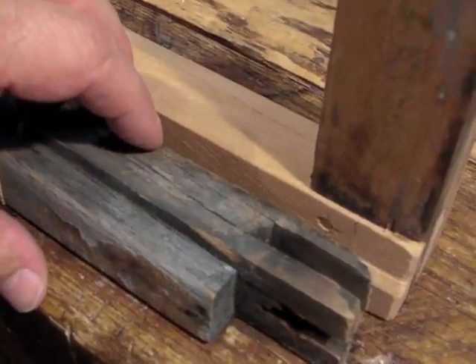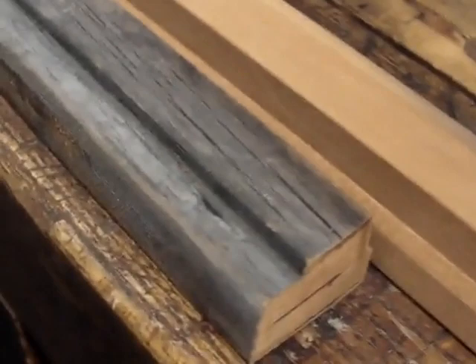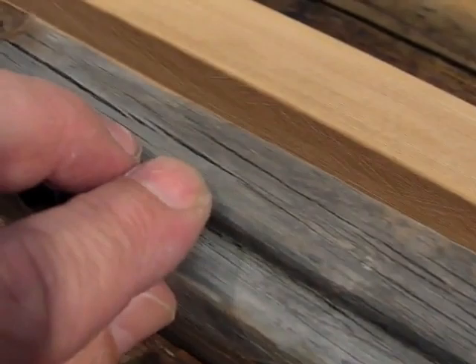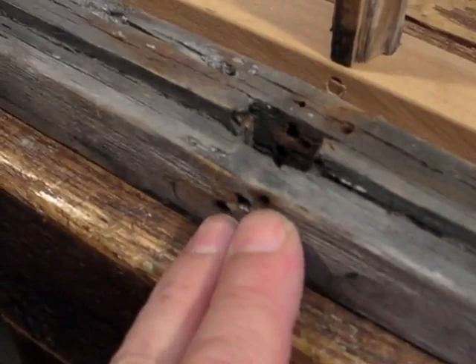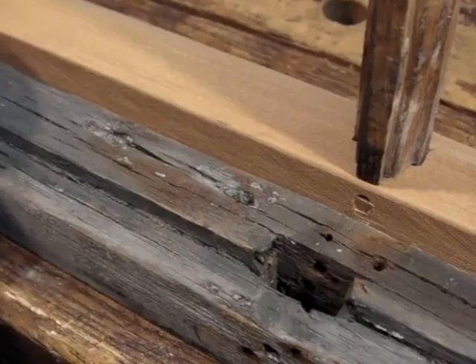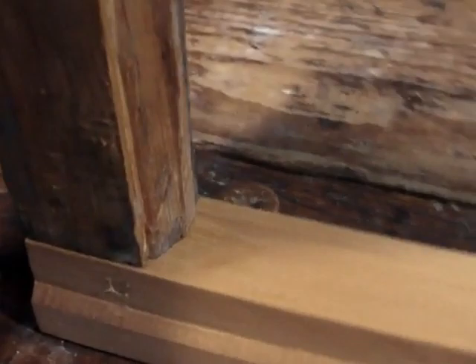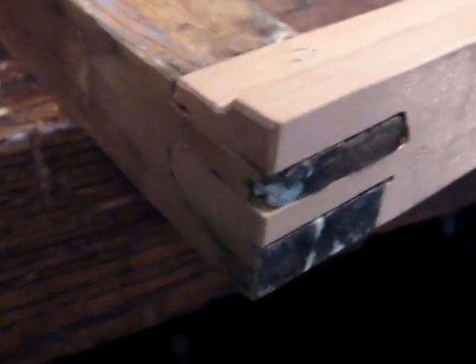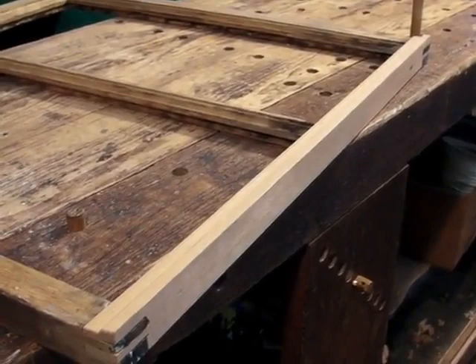To review and wrap up the rail renewal: the old rail had several problems, from broken and rotting-out tenons to ring checks that were splitting up on the bottom side, weather checks all along the top of the old rail, old holes from past latches, and nail holes from poor previous repairs. So I made a new rail, and it's looking alright. The joints came out nice and tight — I think that's a railing that's going to last for quite a while.